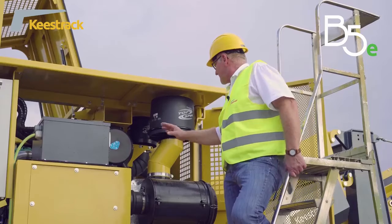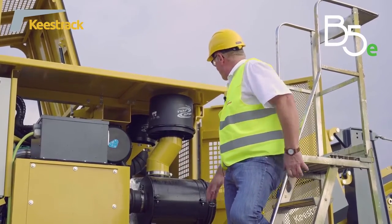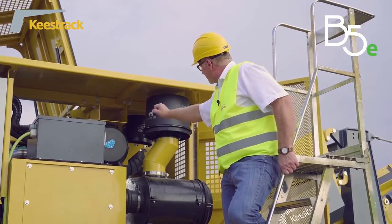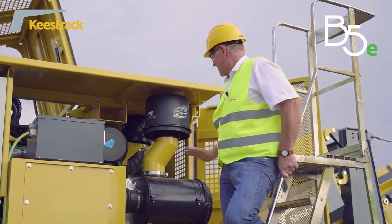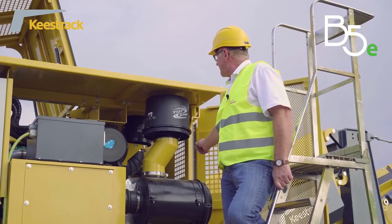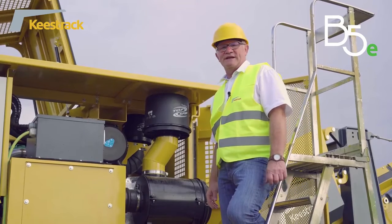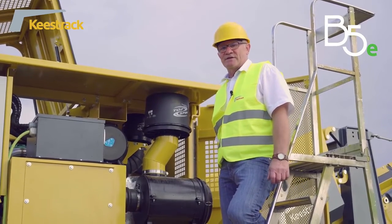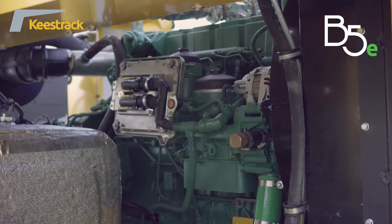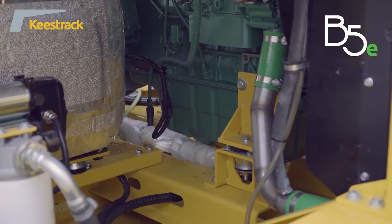The alternator has its own air suction system for cooling of the alternator with a filter, which you can see here, and a separate filter for the diesel engine. All the filters are made in the same range with doors which can be opened easily, for ease of service. So from this side we have access to the engine unit, refueling pump, and to the filter of the refueling pump.